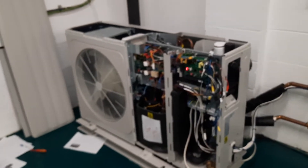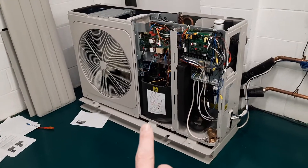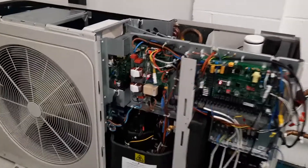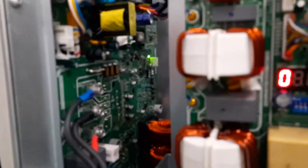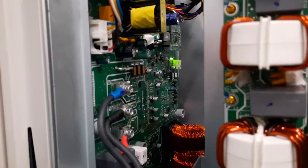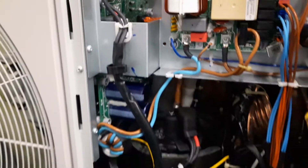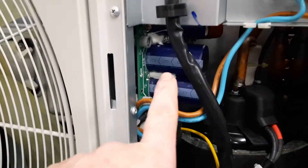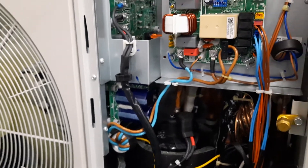When we go to our outdoor unit — I've completely dismantled this one — you're going to need to whip off the right-hand cover and the middle cover. Don't forget the two big screws at the bottom. I want to look at this PCB here in the background — you can see the green LEDs on it. This is what we call the inverter PCB. It's a large one above the compressor, and you need to be very careful as it is a very high voltage PCB. These capacitors here are charged at 370 volts DC.